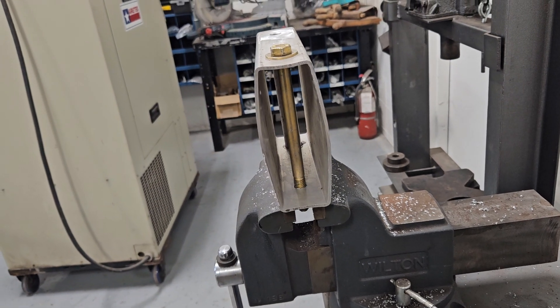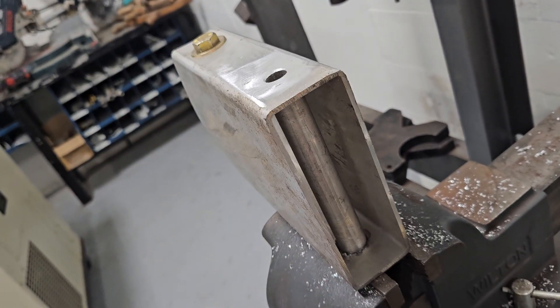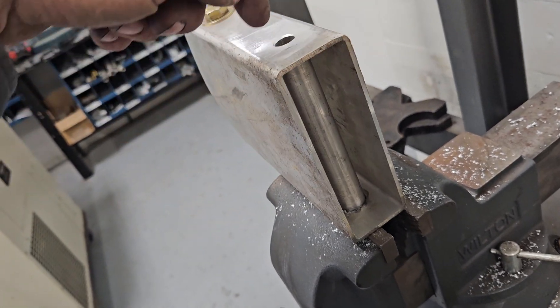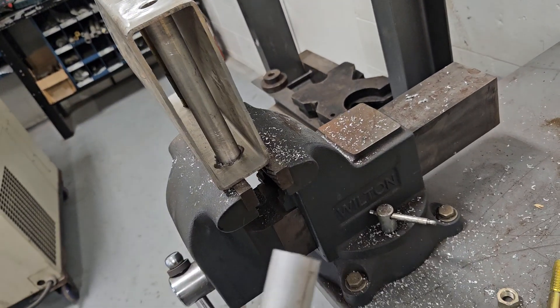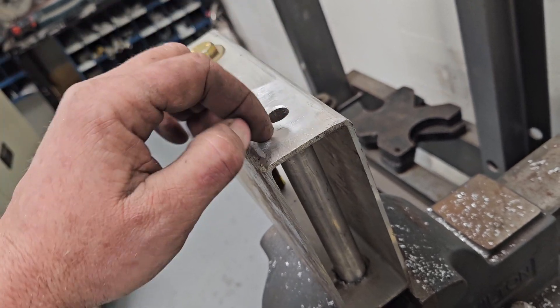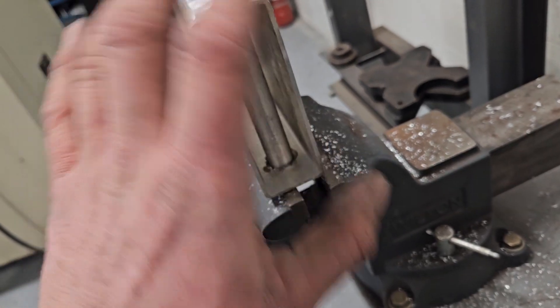Here's what we do at Fully Tech Mechanical. We take a piece of Schedule 40 aluminum tubing, half-inch ID. We cut a three-quarter inch or slightly larger hole top and bottom, mark it, do the coordinates, and drill the right spots on both sides, then punch the sleeve through. We TIG weld it top and bottom, then grind it smooth. We'll also throw it in the lathe — or use a grinder — to bevel the edge so that even when we grind the TIG weld flush, the weld is still seated in that bevel. Any load applied transfers through the sleeve, effectively doubling the material thickness and doing a whole lot more.